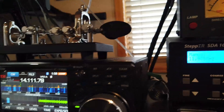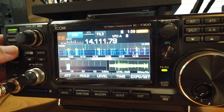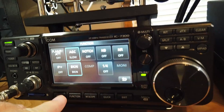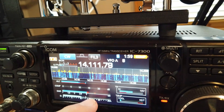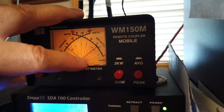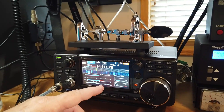Let's go over to the screen. With everything in normal shape, I'm going to leave the tuner off and pick the meters. Here's SWR — look at the SWR right here, it's terrible, absolutely terrible. And if you look at it on this wattmeter, we see that the forward power is about 50 watts, the return power is 5 watts, and they cross about on the 3-to-1 line somewhere in there. But this shows significantly worse than 3 to 1.